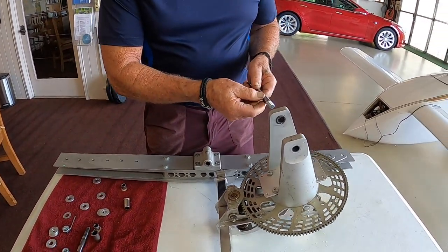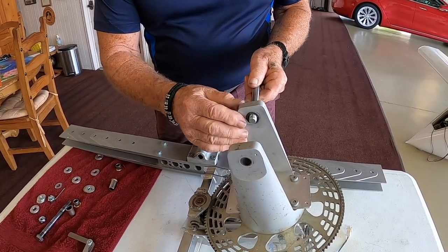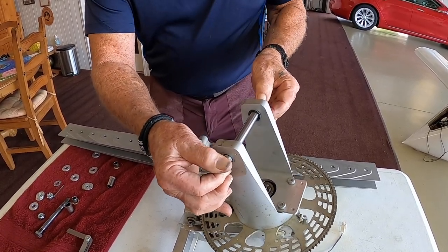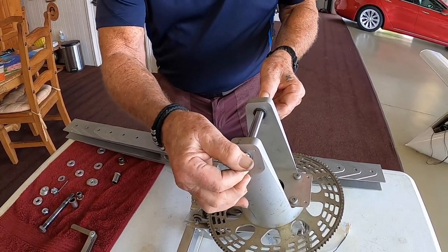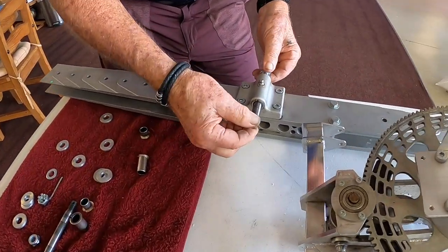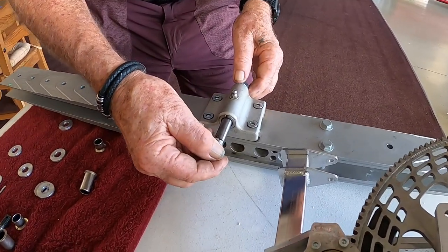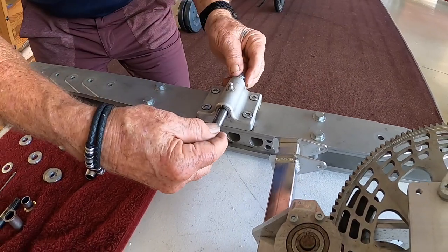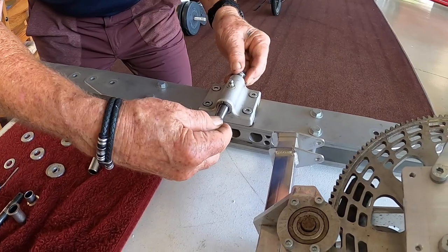To check the bearings in the teeter towers, put the new bolt in and just pull up and down on it to see if you have any movement. There's very little — barely any perceptible movement. Do the same thing with the hub bar teeter block: put it in, and again there's very little movement, meaning very little teeter wear. As the blades turn, they teeter a little bit every revolution — that's the wear factor.